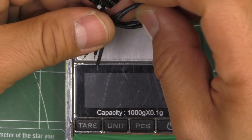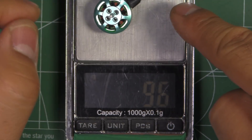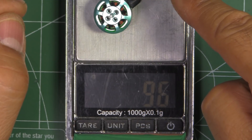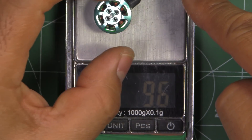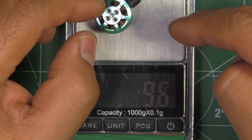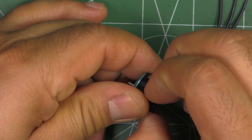With this length of wire, let's see what the motor weighs. It says 9.6 grams. If we cut the wire down to 50mm, we'll be getting rid of about 0.5 grams, so half a gram. So this motor weighs in at about 9.1 grams with the standard 50mm of wire. They give the weight on the website without wires, and they say it's 9.37 grams.